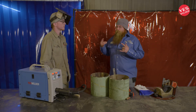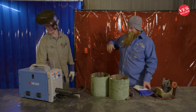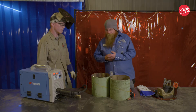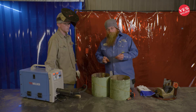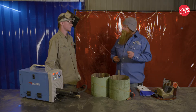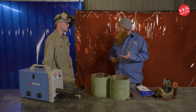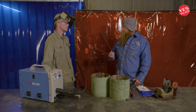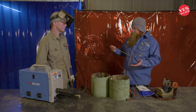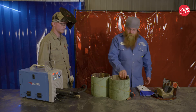So what we're going to need to start out — we're going to need an eighth-inch filler metal so we can throw a gap in this thing. Let's go grab one. Hey, let's just use this 532. So first thing when you're doing an open root, Colton — when you're doing an open root, you want to use a gap strap. Sometimes when you're running short circuit, it is better to run a wider root opening. 532 is actually optimal. Eighth-inch if you've got specialty like purge or specialty processes like pulse. With this, we're on a 532. You just bend a regular wire into a V, basically. This is something you can just use on pretty much anything — throw it in your toolbox, you always have it.